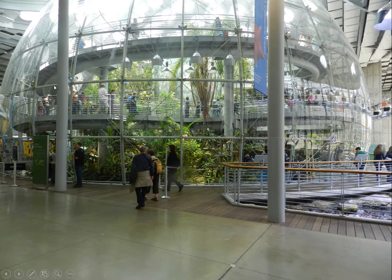Here you'll notice we have a curved bridge, which is only intermittently supported. So if there's a support here and another support back there somewhere, this curved portion of the beam wants to keel over or fail in torsion. And you'll notice in this case, it's been rendered as a round tube. And the reasoning being that that's an elegant way to get good bending action and really excellent torsional action.